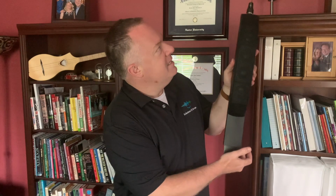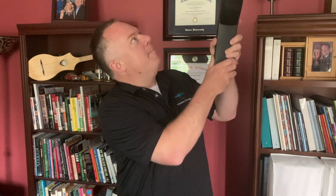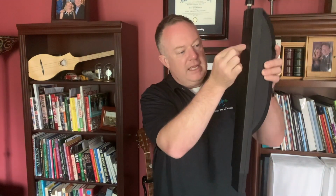I put this up, and with my column array on its highest setting with all the pieces, this gets about seven foot in the air with this guy on top. I point it right at my officiant and couple, so it's going right toward the direction of the source of my wireless microphones. It's easy to take a coax cable, connect this, run the cable down, and connect the cable to my microphone receivers. In my video, I talk about having combiners, taking my receivers so they can all take advantage of this one shark fin. But guys, this has decreased dropouts and eliminated them.